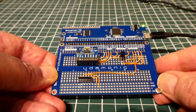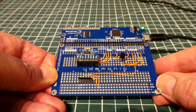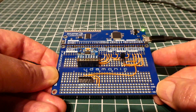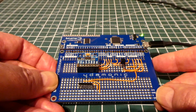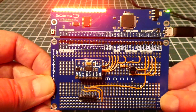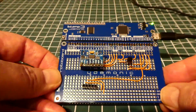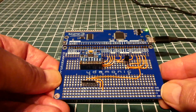I have code running on the SCAMP3 board reading the ADXL345 accelerometer. If I tilt the accelerometer greater than 45 degrees, the LEDs on the top come on — it's a tilt detector. Tilt it up past 45 degrees and the LEDs come on; bring it back down and they go out. Next we're going to look at how to build a free fall detector.